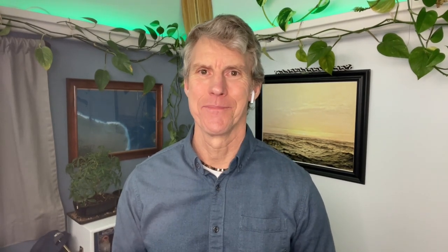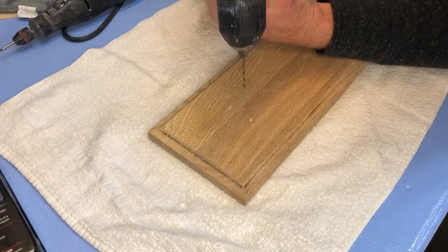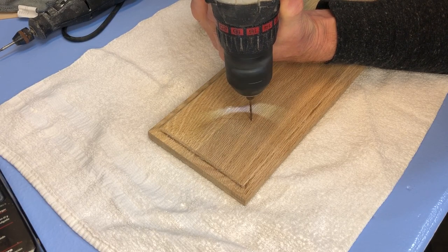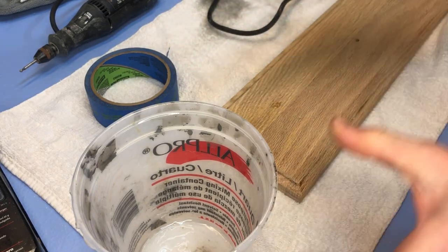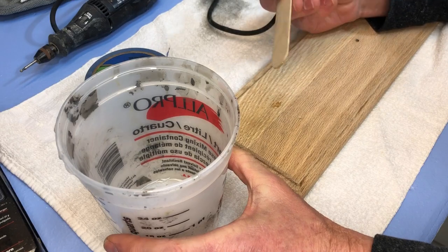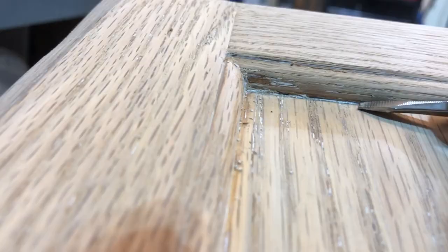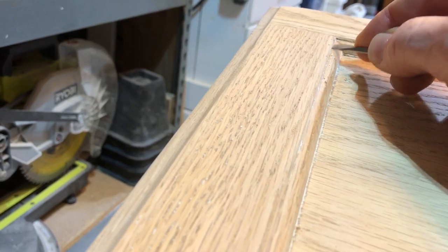All the learning I did in this process of bleaching and refinishing red oak. There were a couple holes here in the front of the drawer, I think from possibly me drilling from the backside or putting in some screws from the backside that went a little too long. So I'm drilling them out a bit because there's paint in there, and then I fill them with clear epoxy. And despite a heat gun and any chemicals I used and different fancy sanders, there's still no getting away from using something like a small flathead screwdriver to gouge out all that paint in the little heads and cracks and corners and grooves.